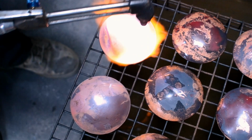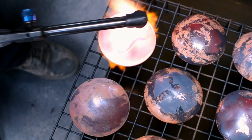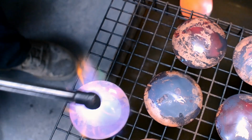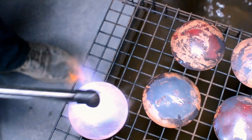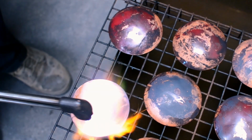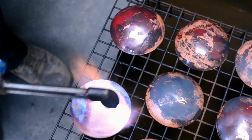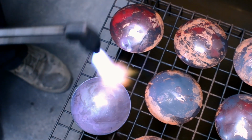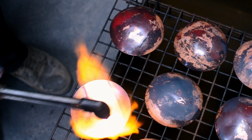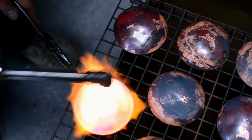As you start to heat the discs, you will see the changes in the colour. It's quite difficult to see with copper. You have to take the flame away from the piece of metal so you can see the real colour, because it's quite shiny and reflects a lot of the light back. When you're annealing it, you're looking for a nice cherry red colour. And when it's quenched, you get these beautiful oranges and blacks and sometimes slight blue colours and deep reds. It's just the oxidisation because it's been quenched really quickly, and you get this lovely patina.